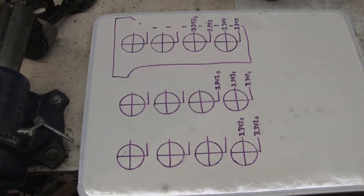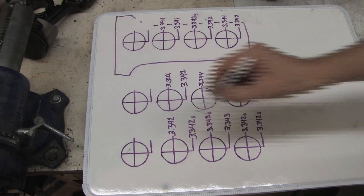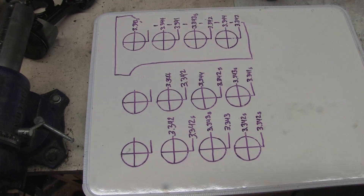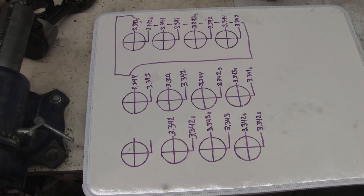Telescoping gauges are a perfectly acceptable way to do this — they're tedious but very inexpensive. Each measurement should be repeated several times to ensure you've got it right, which means essentially 72 measurements to come up with the 24 values on this chart. Unless you're very gifted, this process takes time. You don't need to see me measure all of these, but I'm stressing that point just to let you know what kind of time these edits are saving you.